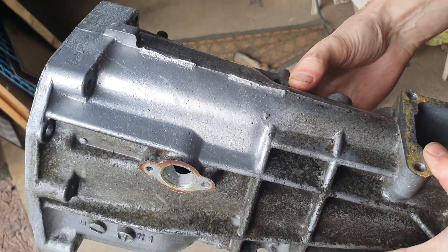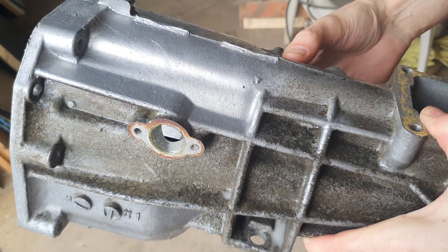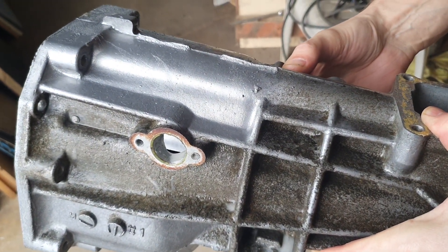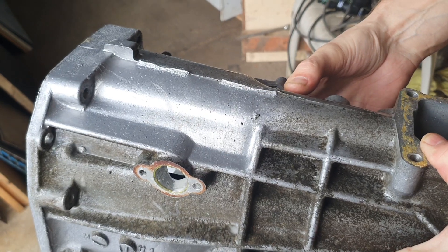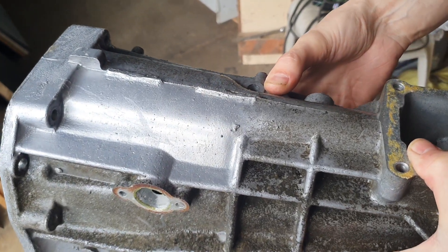So that's come up really nice, really quickly. It seems to be that additional flow through that nozzle — just that different nozzle shape. Like I say, everything else on the gun is absolutely identical; I've literally just changed the way that the retainer works on it so we can use that different ceramic.